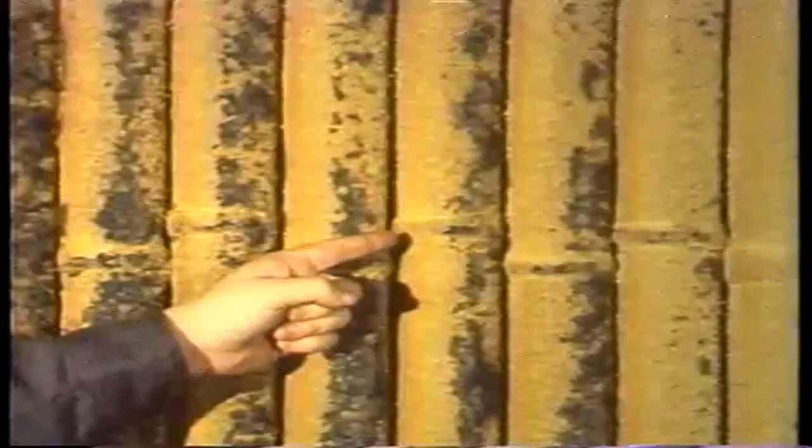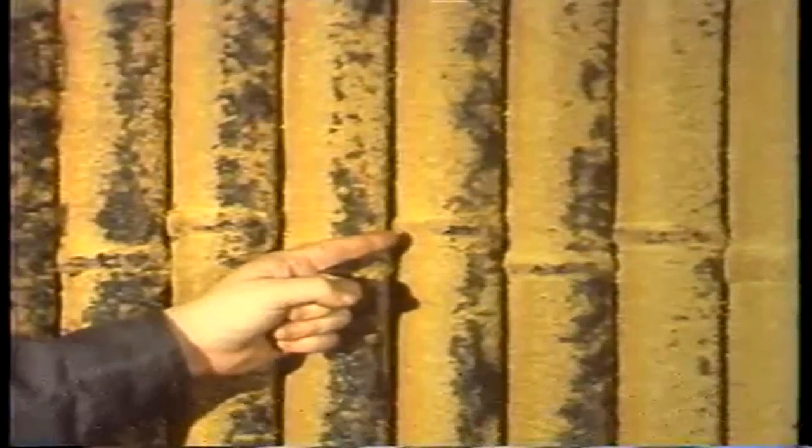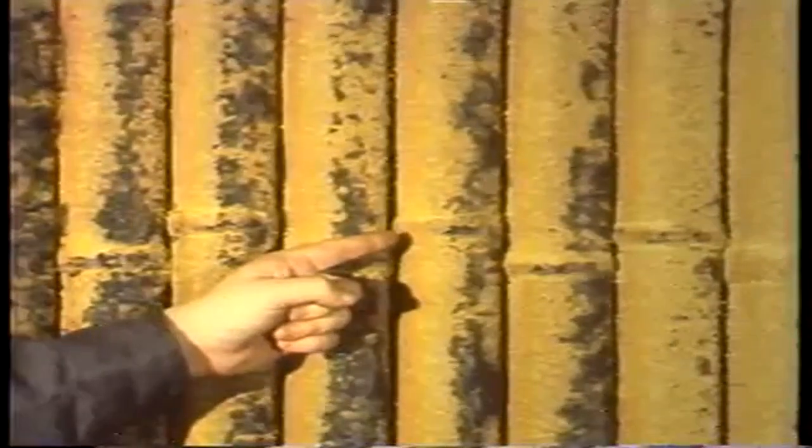Another water wall item to check out is construction welds. These joined the tubes together when the boiler was first built, and they're subject to leaks. Leaks in general are the fourth potential problem in the water wall tube metal. Since the boiler is shut down during inspection, water may not be spouting out of the leaks unless the boiler is under pressure. So, to detect leaks at the welds, look for dampness on the tubes or discolorations of the water wall. Any visible erosion or corrosion anywhere may be evidence of leaks. Also, any tube crack may be a leak.